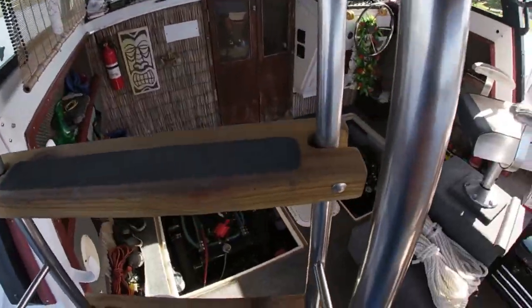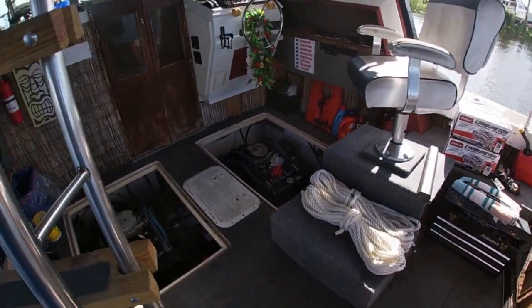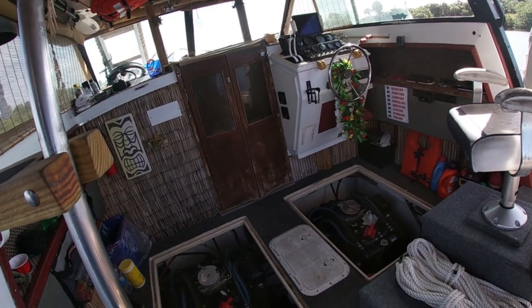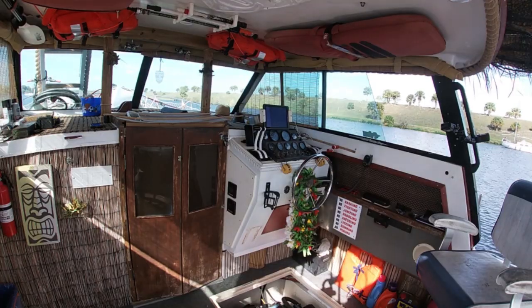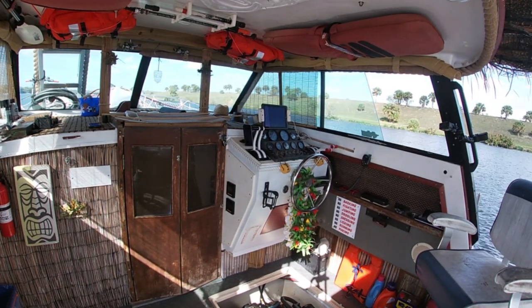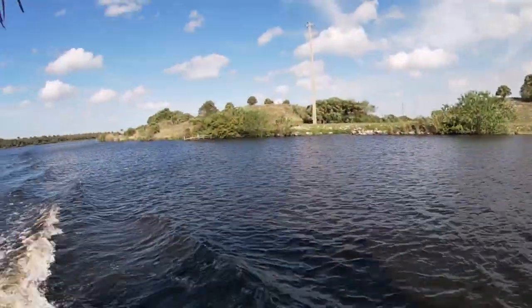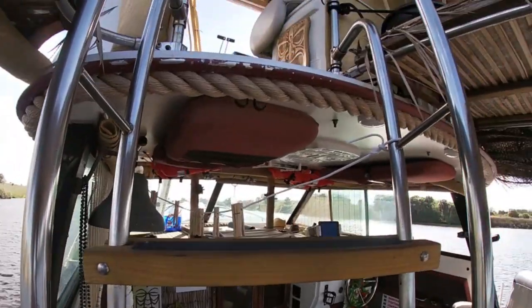Did you have a brighter light anywhere? So once you get your engines first running, you want to do a little shakedown cruise where you have the hatches open and you're able to stare at them, looking for anything abnormal, any abnormal sounds. Marty was watching all the gauges, so I was just looking for anything out of the ordinary, and we didn't have any major problems. Temps are good.